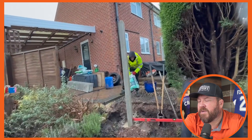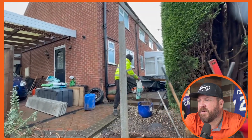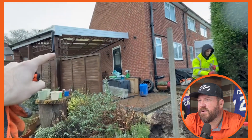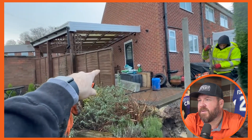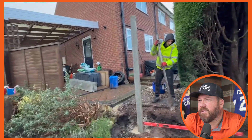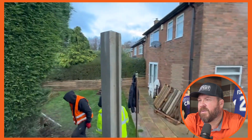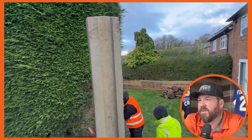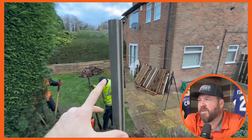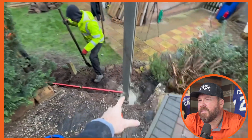You can see two bags of concrete — it's got a good amount of concrete around it. We've got our first post in. That's going to be the height of this bay. It looks tall now, but that is only a five-foot bay. So when six-foot comes up, it will be running across at six-foot. I'm six-foot now and I'm standing pretty close to the height of this. It might be slightly taller by a couple inches, but this is the plan.